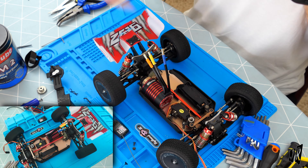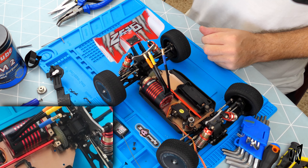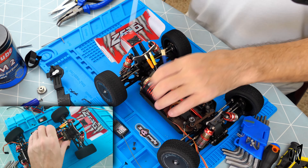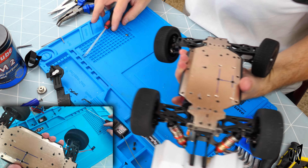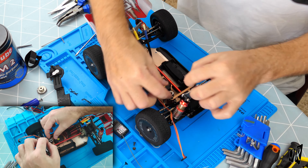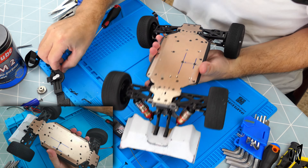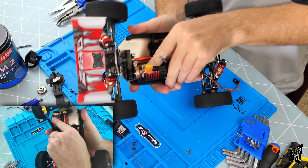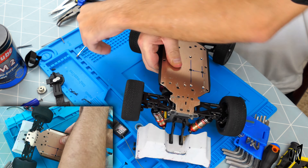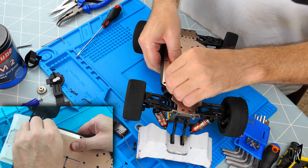He promptly drops it and gets nail polish on his fingers. Does anybody see my mistake? Did you notice? What I did wrong was the thread going into the motor - there's only a tiny little bit, and obviously I did the nail polish much further up so it will have no chance of ever being held on that thread. So I need to take it out and do it on the last little bit. I don't know how quick you have to be with this stuff - I assume quite quick, although I do see my wife blowing her nails for several minutes. Try again shall we.